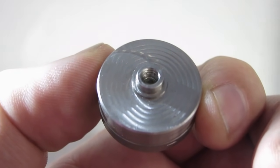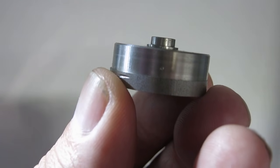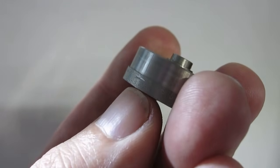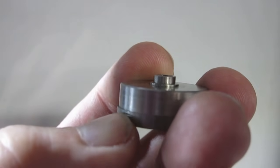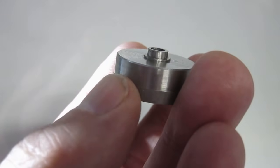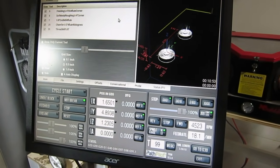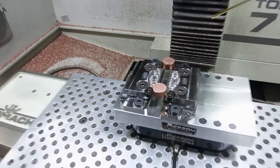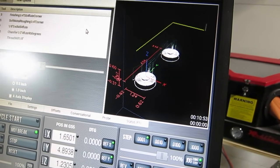This is actually the bottom side of the button where the grub screw goes in, and we get all the depth we need on this cut. You can see this little mark right here — this is where the fixture teeth cut into it to hold it in place, so it's only held by this much. That allows us to machine all of the profile and the entire bottom side of the button. This is the program in Pathpilot, which is the software I use for the Tormach. It gives you a representation of how it looks on the palette, and I can watch as it makes all of the toolpath cuts — the entire operation is animated.